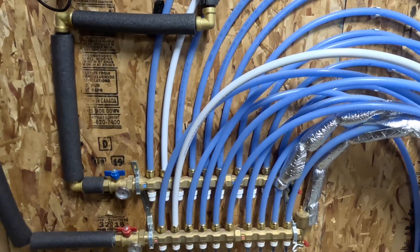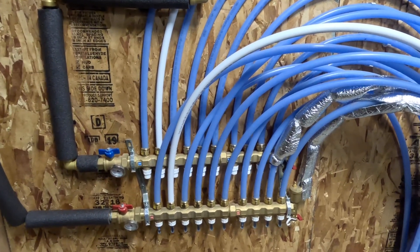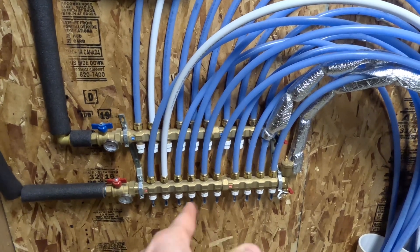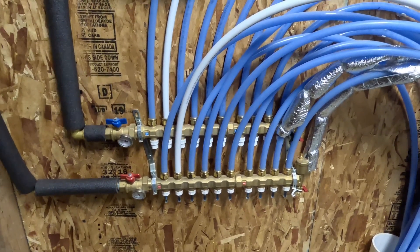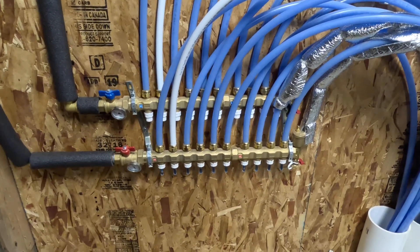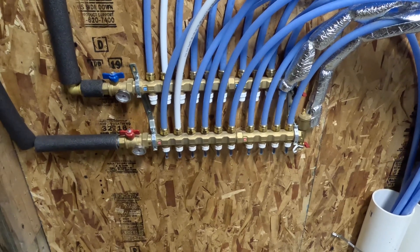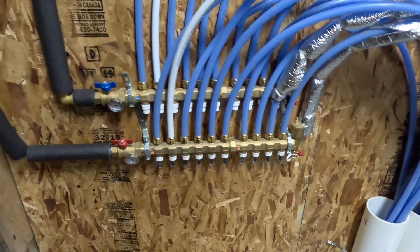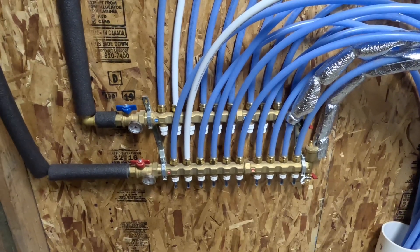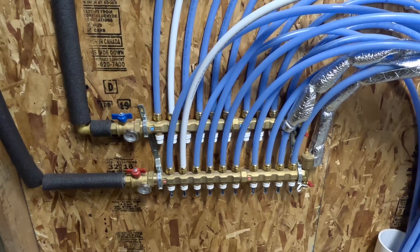The flow rate is 100% double — I got it on the highest setting right now because I want to get it up to temp quick. I need to readjust all the flows. There are two loops — loop 4 and loop 10 — that will always have the least flow because those are the shortest runs. I try to slow those down so they equally get up to temp.